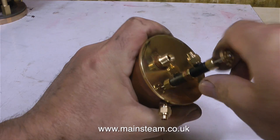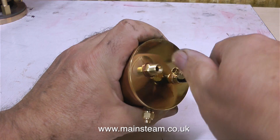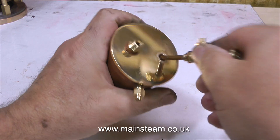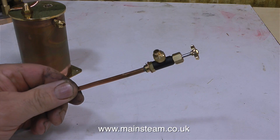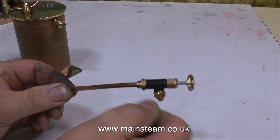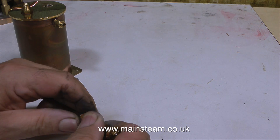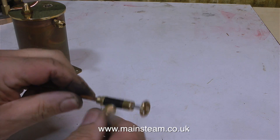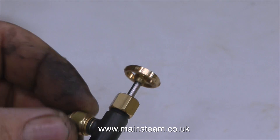I'm removing the drain tap because I do not want it in a black paint finish. In order to get rid of the paint I need the part to be immersed in cellulose thinners. This is not just a tap — it has a long pipe that goes to the bottom of the condenser oil trap. All you have to do is run the steam engine, connect a pipe to the outlet of the steam tap, open the steam tap, and the exhaust back pressure will pump out the water followed by the oil floating on top, into a suitable receptacle.